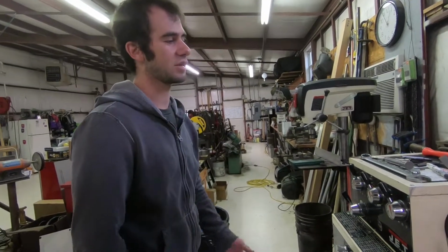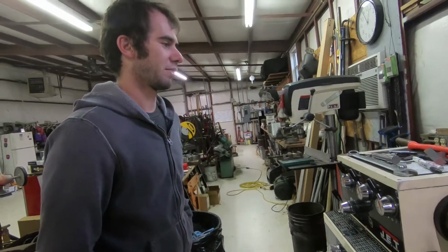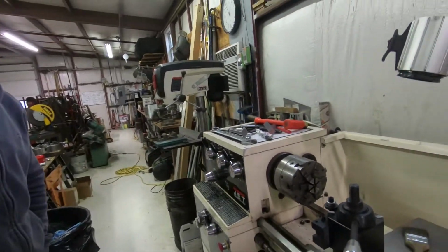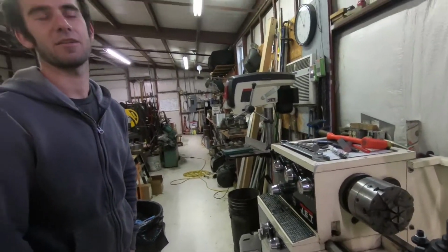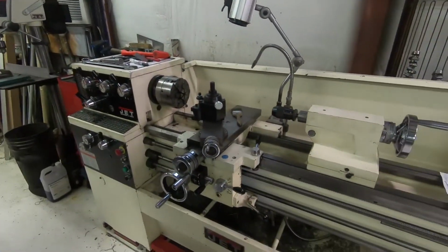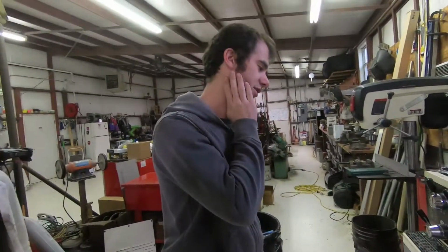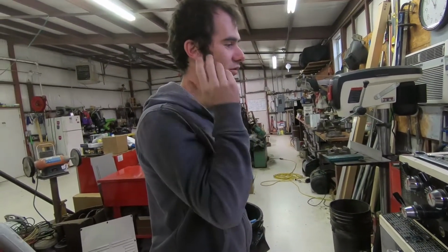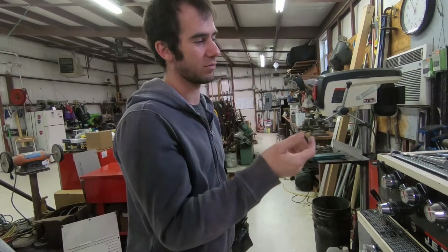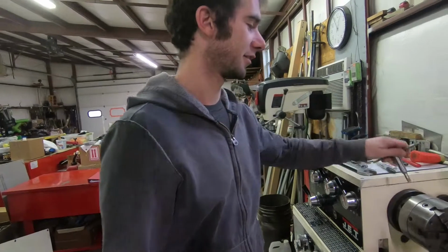And you can hold on to odd stuff. But like making a handle, it doesn't matter if it's half a thou or 1 thou. It really doesn't matter. It just depends what you're trying to do. A true machinist would say their favorite chuck is the 4-jaw, because you can hold on to everything and you can get it perfect. It just takes time.